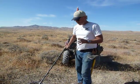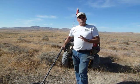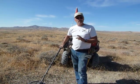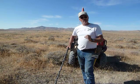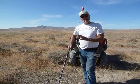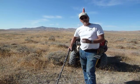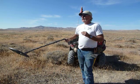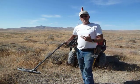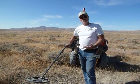Again, there's been some talk about the TDI having a little quirk. Well, it's a defect. You get this bounce back, boing, chirp. Well, you don't, as you can see, okay? You do get that sometimes in the right kind of mineralized ground. You do that in serpentine, there's no chirp. You get it in hot red clay, and yes, there's a little bit of a back bounce when you bring the loop back up off the ground. It's not a defect, it's just a quirk of the machine. It does not affect the performance at all. Okay?